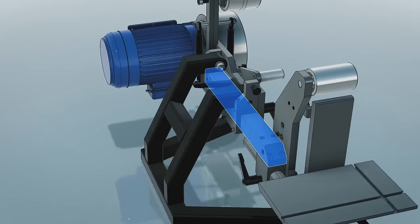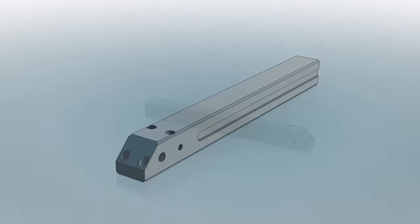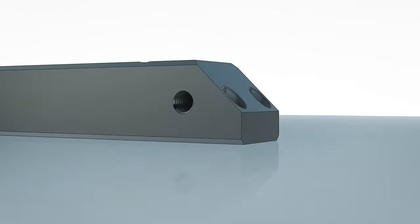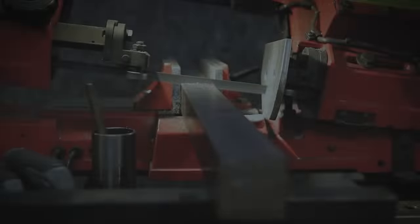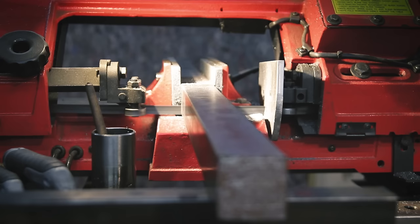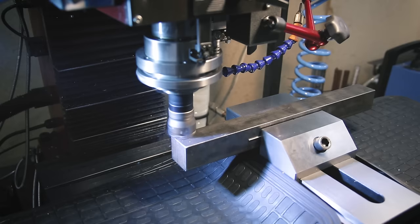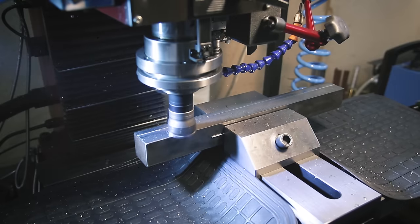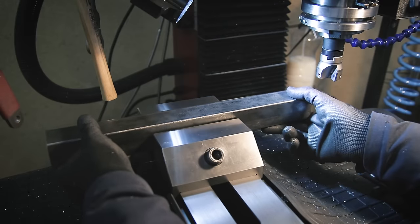There's still a lot of parts waiting to be made, and the next one is this attachment arm. For this design it holds both the platen attachment and the work table, so this is pretty beefy and made from 40 by 40 millimeter square stock. In this case I didn't buy the stock oversized because it would have been too much work to mill everything down, so after facing all these sides it's going to end up slightly smaller than 40 by 40 - but I did account for that when I was making the parts for the sleeve that this goes into.